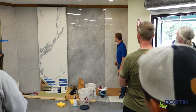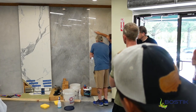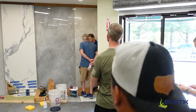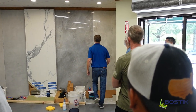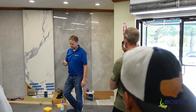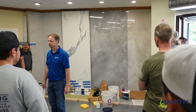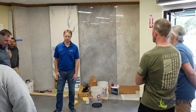You can see haze showing up here — watch my finger. See, it's rough. At the right time you can take it off with your finger. If you Windex it and wipe it down, it'll come completely clean. That's grouting with pre-mix.